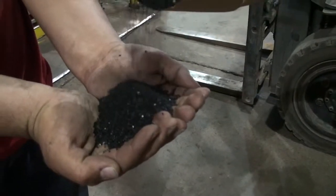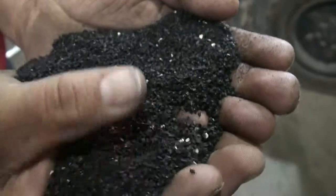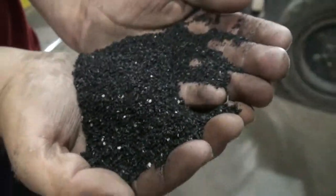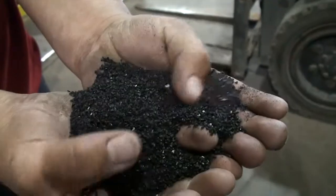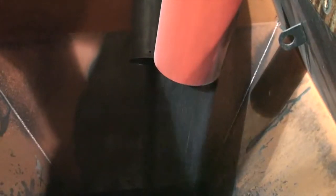The fourth stage of processing is to mill the crumb and to screen for the sizes needed to meet your market demand. As seen here, this 3/8th minus rubber granulate can be milled down to minus 20 to 80 mesh fine rubber powders. Utilizing a CM dual drive cracker mill, the granulated rubber is cracked or milled between two serrated hardened rolls. The rolls are positioned very close together to achieve the cracking of the rubber.